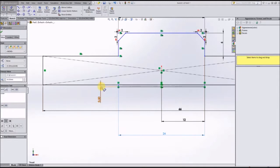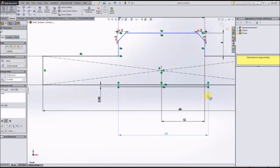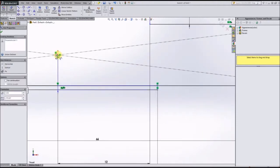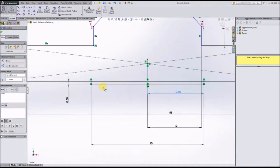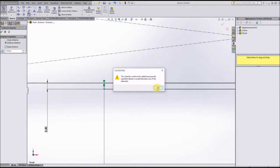Because this is 1/2 of a millimeter thick and is a 45-degree chamfer, we know each of these have to be 1/2 millimeter wide. So with each of these being 1/2 millimeter wide, that means we need to add 1 millimeter to account for both sides to the width, which also means that we need to go and recenter this. So this needs to be 12.5 now because it's 1/2 of 25 millimeters. So now that we have that, we can do a sketch chamfer, and we make that chamfer 1/2 of a millimeter. We can go and click these two corners.